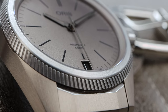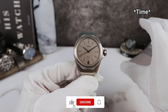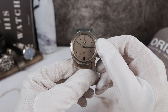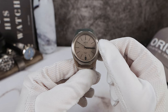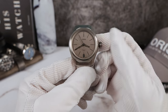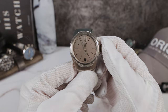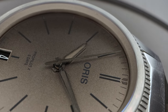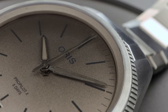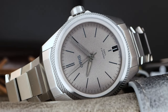When Oris released this movement and you were setting the date, the minute hand would jump, and people were upset. I think they added a gear to dampen that interaction. Let's check it out. There was a hack before where you would have to pass your intended time by 5 minutes, go back, and the jump would disappear. But now you can just go forward — and it doesn't jump. So I'm pretty sure they did an update with new movements. There are always going to be minor improvements over time, and that is one of them. So if you have one of the original Calibre 400s and you're worried, when you do your 10-year service they're going to add that extra gear. No problem.